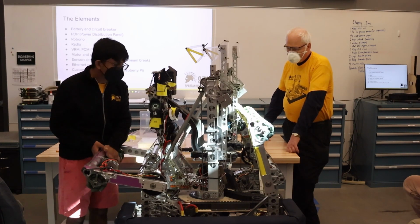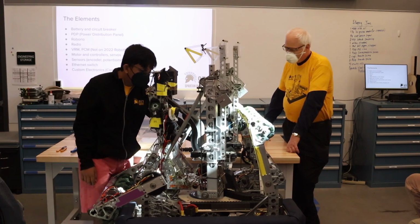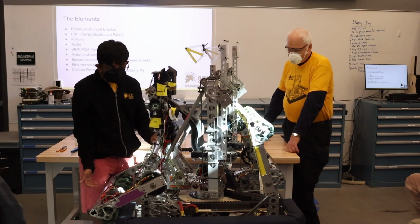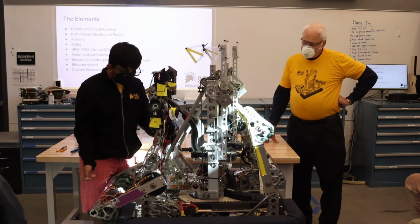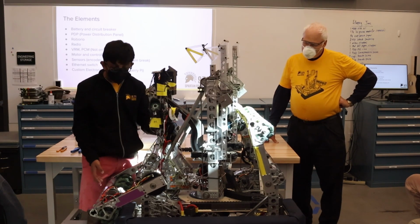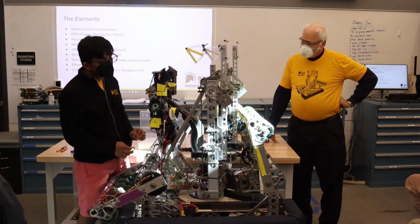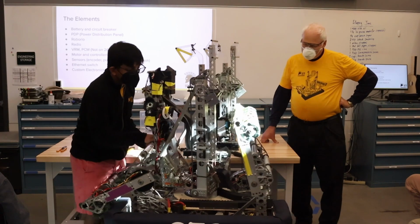We don't have much CAN going on this robot. We just have the intake rollers front and back, the PD board, and the flappy arms here. That's just because they don't need a control loop to run them. It's just on off. Our control loops can't run with the latency that CAN has. So that's why none of the actual important subsystems like the catapult or intake or turret are powered using CAN; they use PWM.